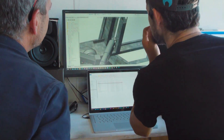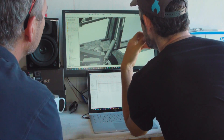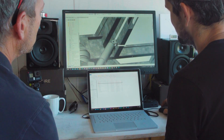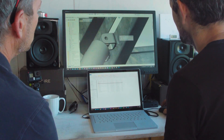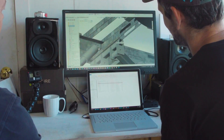I think we remember last time we had a bit of discussion about the integrity of all of this. When I looked at the drawing for these guys in a bit more detail I would recommend that you have a 4mm backing plate on the RHS as well. I'll have a bit of welding to do, but I reckon that's going to be pretty strong and light.